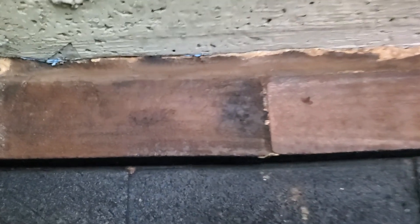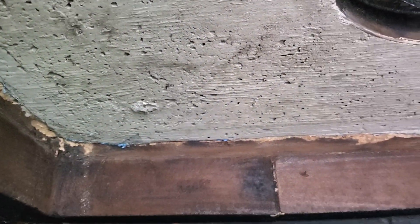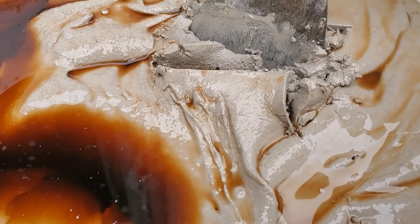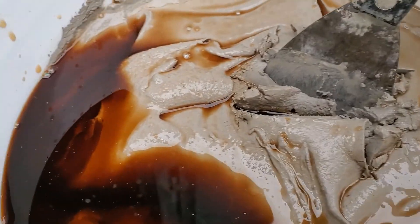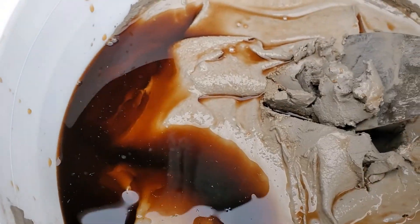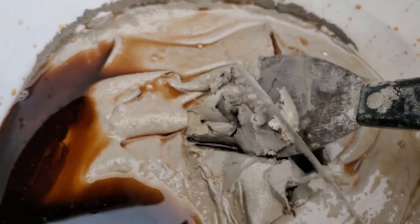The tape cleaned up really quite nicely, and I've gone ahead and brushed off some of the fire brick and the mortar in there. There are the odd little pieces I can't dig out all that well, but this concrete is going to be covered in refractory mortar anyway, so by wire brushing off the fire brick and the existing mortar, I'm preparing that surface for the refractory stuff. The refractory mortar I'm using is called Sairset, and my plan is to use these putty knives — a wider one and a narrow one — to apply it on the inside.